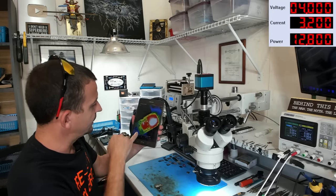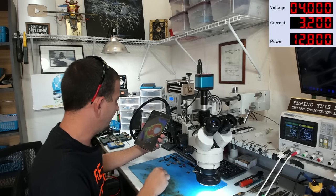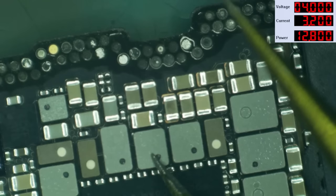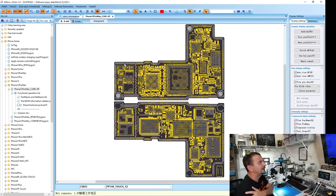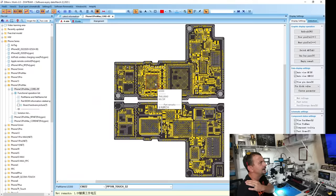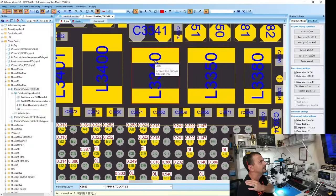I've just paused my video so I can see exactly which coil is getting hot. And I'm gonna track this down on the board. And that is the coil right in the center. That's gonna be this one right here. So if we have a look at that, I'm gonna use ZXW tool here. And let's see, that was right next to the main PMIC. This coil right here,